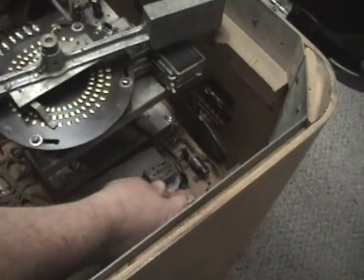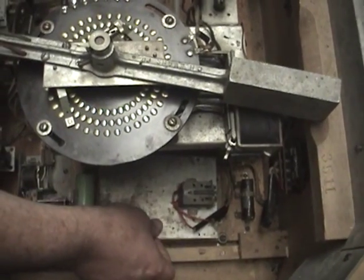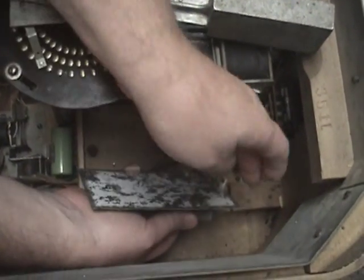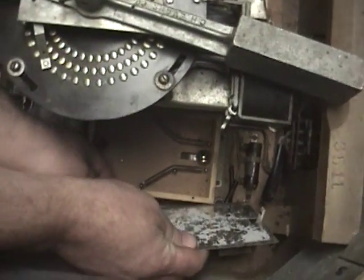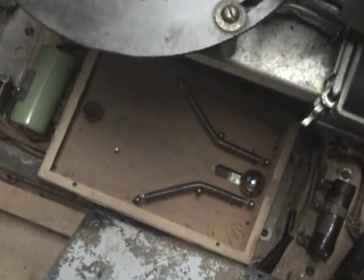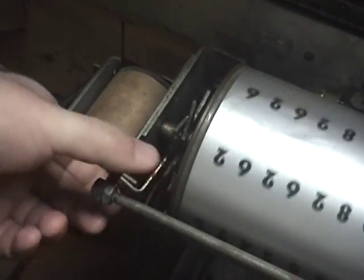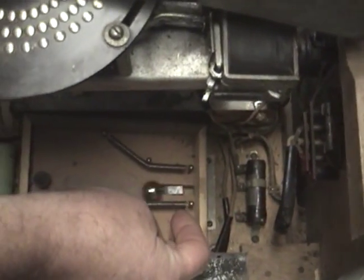One thing I wanted to show you is the way the odds work — there's a ball in here and there's a relay. What happens is this relay gets made and it pushes this, which pushes the ball. Basically the ball just rides up, lifts off the switch, and then every time it comes back it makes the switch. As it makes the switch, this coil gets energized for a second and it will spin these — spin your odds. And as that's doing that, the relay again will kick up and come down.